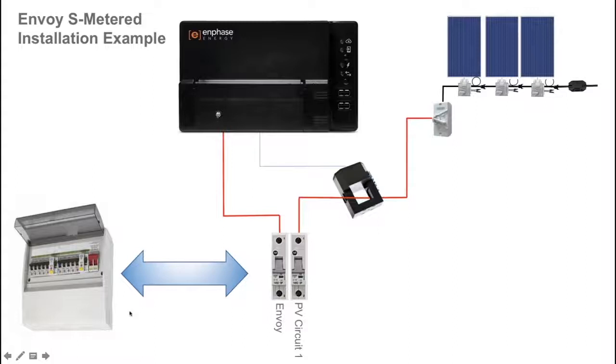These circuit breakers that are wired on site can be either installed in a main switchboard, as the indicator arrows here show, or often for simplicity and for added room for mounting you can install these in their own subboard connection, which enables you to simply fit off your solar and battery circuits.